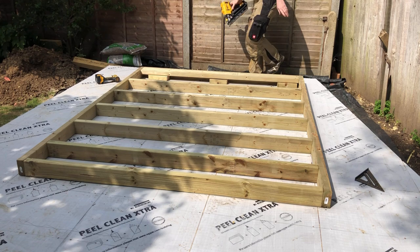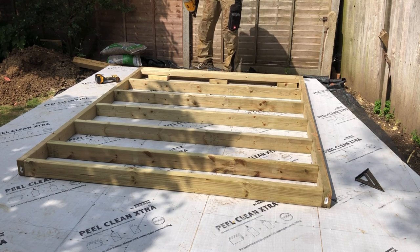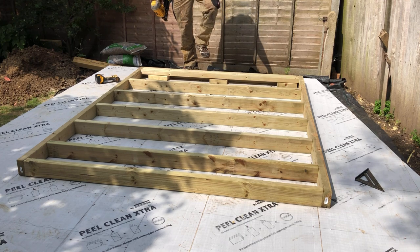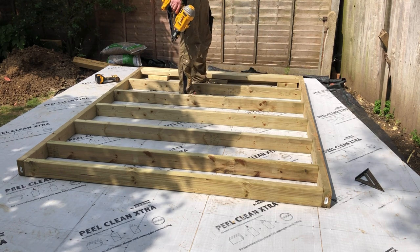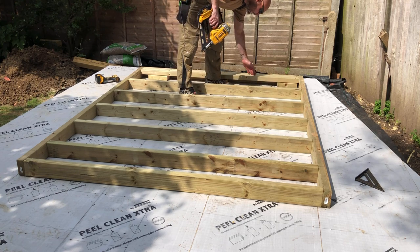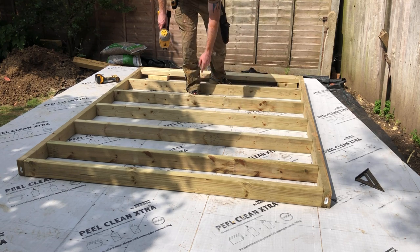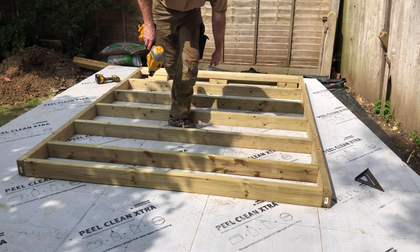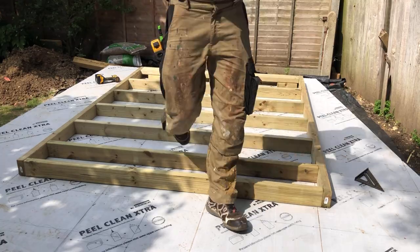Out now, so there's a box in there, but you get the idea. That is essentially the first part of that wall done. Now, because they're all cut, how easy is that? They've all got their 400 centres, so I now know when I've got this wall built and I'm plasterboarding, I've got the perfect start, the carrier. It'll finish on a 1.2, and then there'll be a half a stud that the next board can then carry on from. It really is simple.